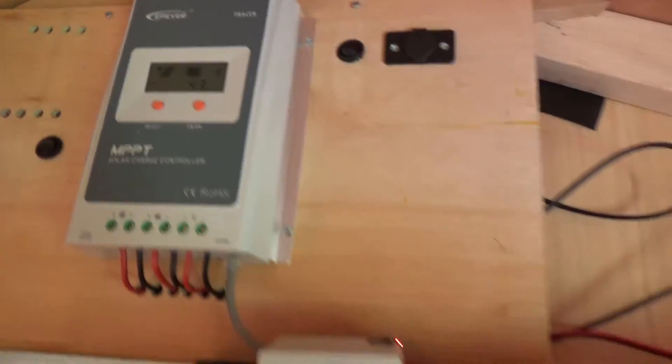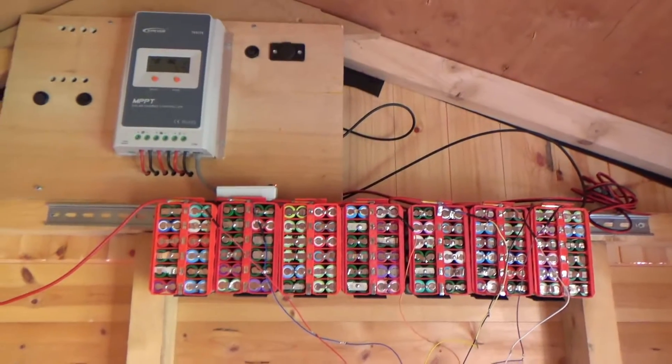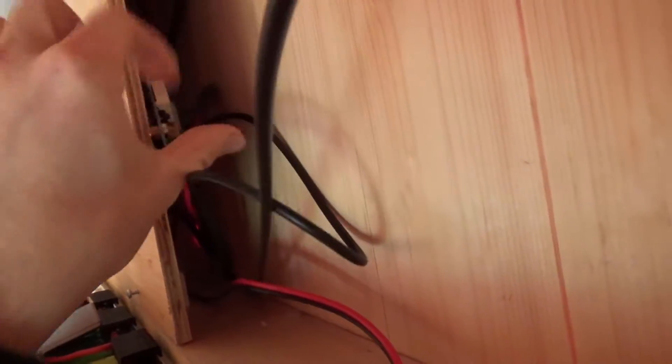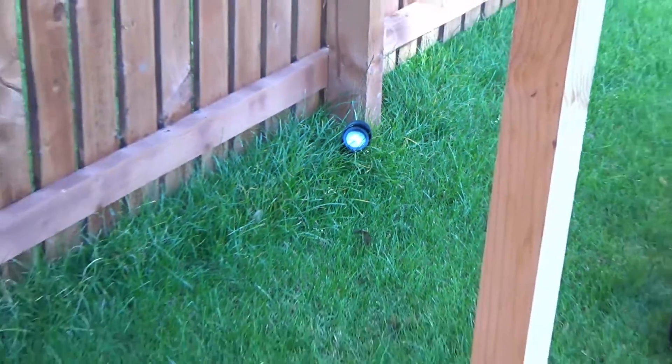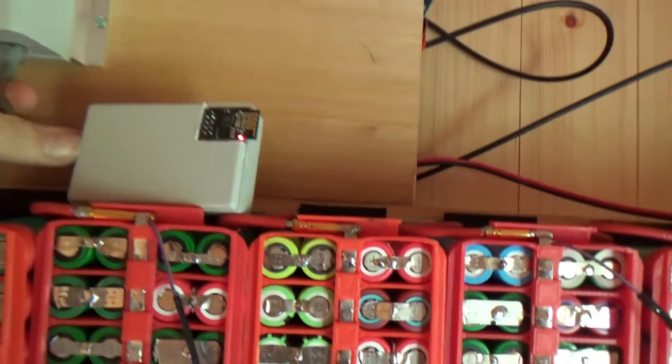It's fantastic, and it's just a shame that it's actually sunny for once but the battery is full and not being used at the moment. The only big downside is that it's a 24 volt system, so there's a small DC-DC converter - it's a 75 watt DC-DC adapter. The only thing hooked up right now is one single 20 watt LED light, with another two lights at the bottom of the garden. Just playing about until I get things sorted.